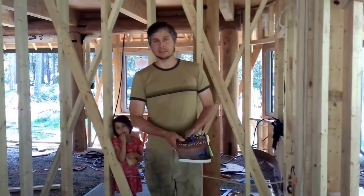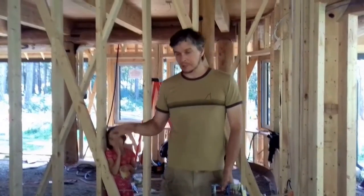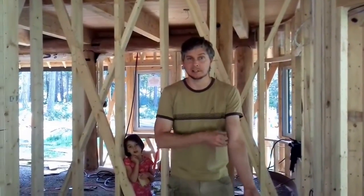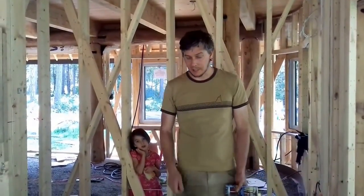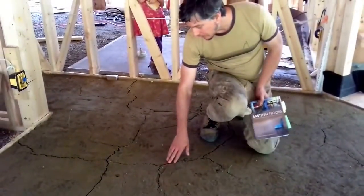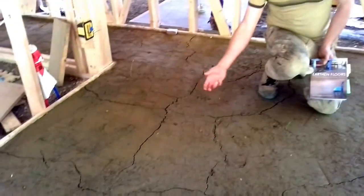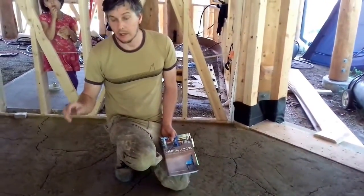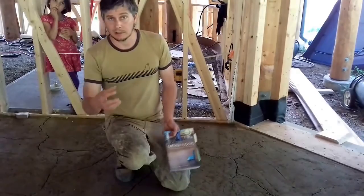Here we are in the bedroom on the main floor of the house where we put down the one-to-one mix of native clay soil — which I believe has more than 25% clay content based on a ribbon test. Based on our erroneous samples we put down this huge amount of flooring, and you can see what happened: we have cracking throughout the floor. It's quite a thick floor, around three inches, which is probably sub-optimal, and there's a lot of moisture that went into it. It appears we have too much clay, or not enough sand.